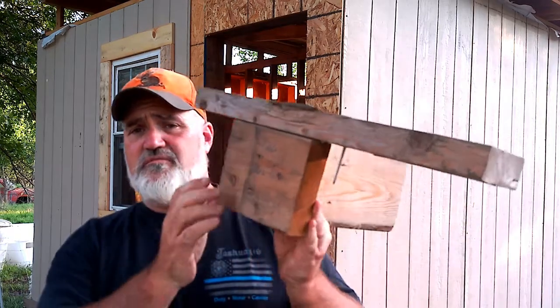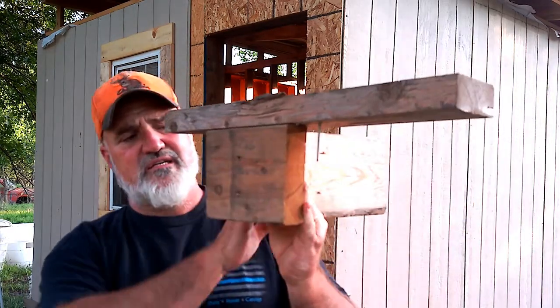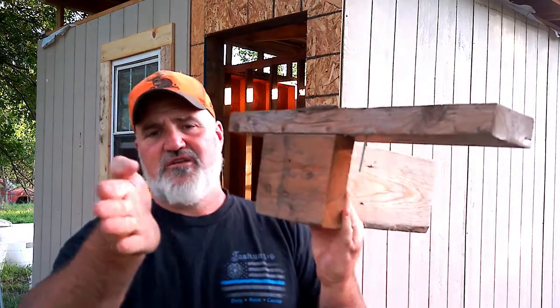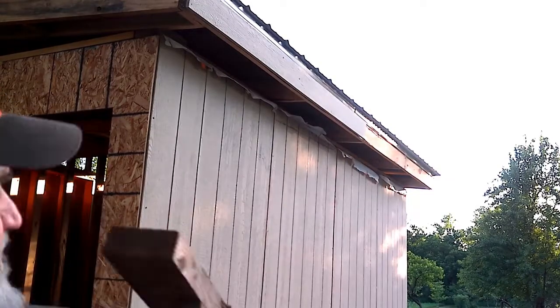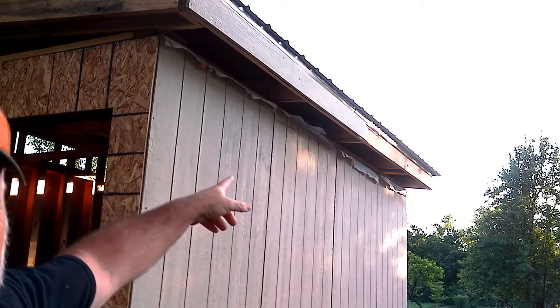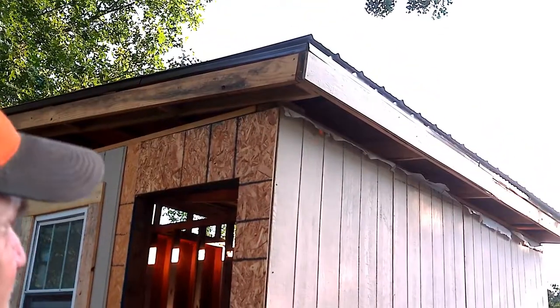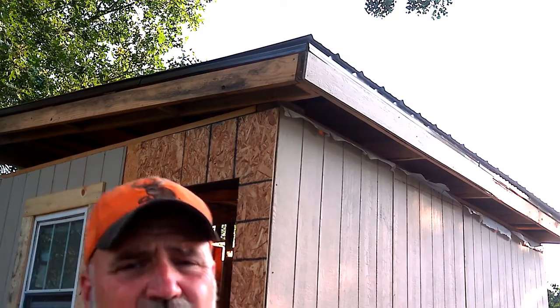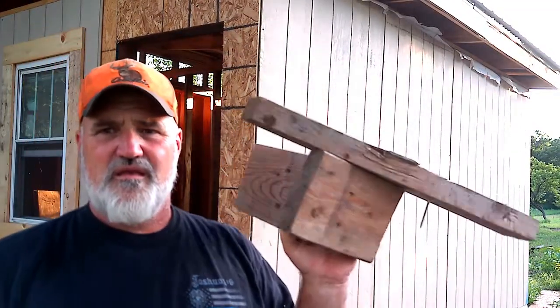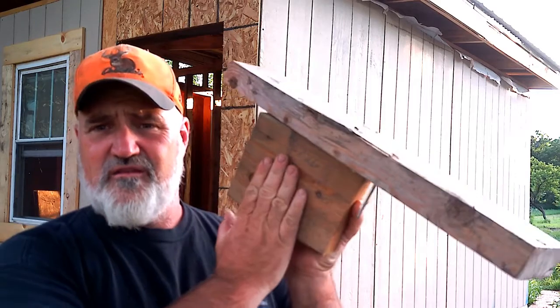In this case, I used a roofing tin. On the end of the joist goes your sub-fascia. What this is, is 2x6s, same width as your joist, and it just nails right on all the way across. You can see it up there — that's the sub-fascia. And then on this end, it's maybe kind of hard to see, is your fascia material. It gets nailed directly on to the sub-fascia.